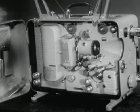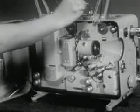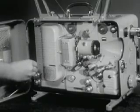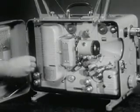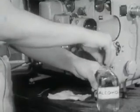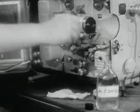All guide rollers on the AQ-2A1 projector should be lubricated with 2135H oil every 100 hours of operation or every 60 days. Film guide roller shafts are oiled every 250 hours. Clean the sprockets and shoes with the aperture brush moistened with pure grain alcohol.